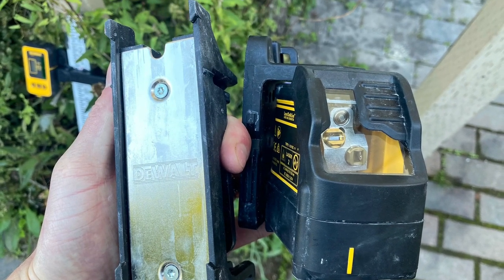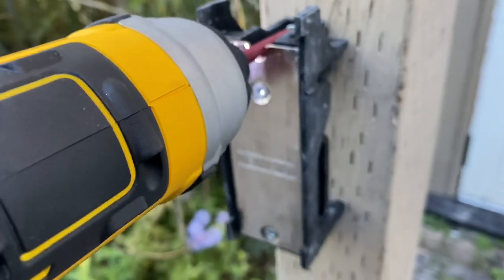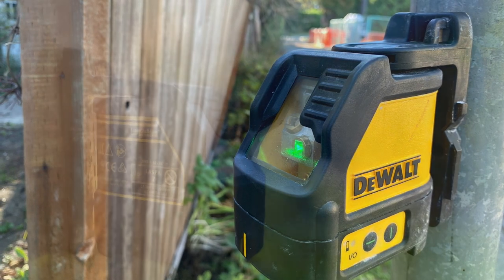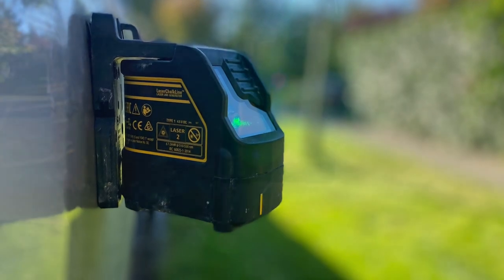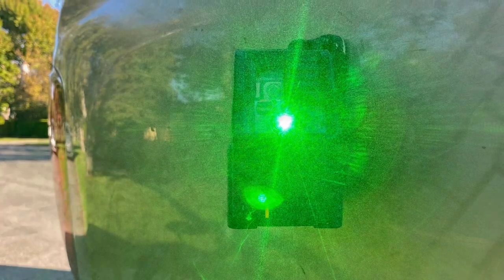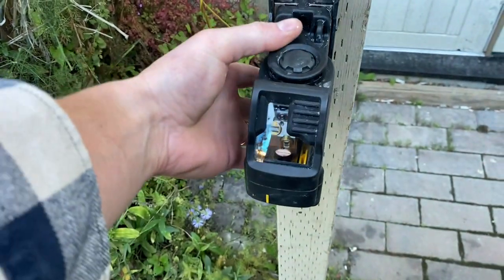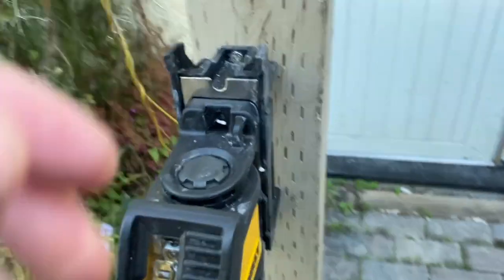You can also use a smaller, simpler version which isn't a rotary laser — it's just a stationary laser. This newer technology uses a green laser light and it can be mounted virtually anywhere. It's magnetic, so you can put it on a pole, attach it to the side of your truck, or use a screw and the bracket that comes with it to attach it to any wood or fence post. It does only shoot in about 180 degrees, but it does swivel as well. With the mounting bracket attached to a fence post, it leaves you a little bit of room for it to travel up and down by a couple of inches, which is handy.